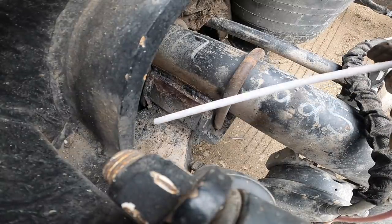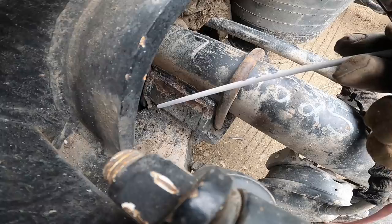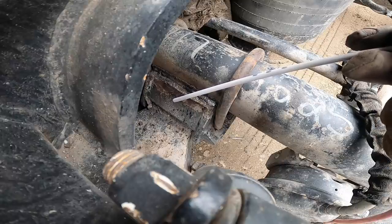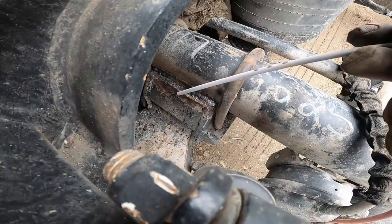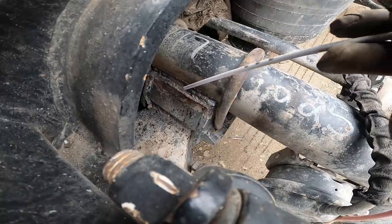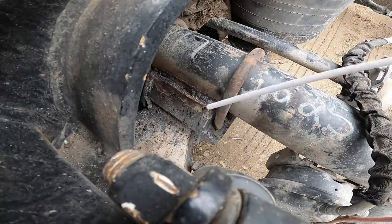Okay, so I switched over to the 5/32s, 7018s. These are Excaliburs. I have it set at, I think, 128 amps. Not too hot, now that the material is already warm. I think I go between 128 and 134, depending on the position. So, like, 134 maybe max if I'm doing anything vertical. I was welding some big pipe casing the other day at 134, but that was 3/4 inch thick, so it's pretty solid. This being a flat weld, should be all right. I'll have to see here in the next few minutes as I start welding this.